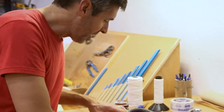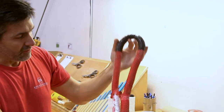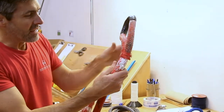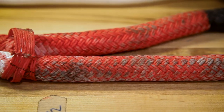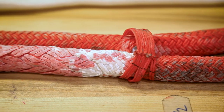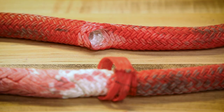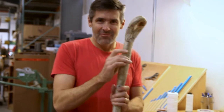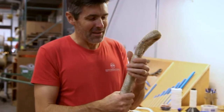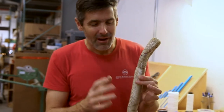Here's an example — this is from a major manufacturer — and this is just the tail end of a utility pulling rope. I cut this one apart to save you the work. On the outside, the stitching was just this decorative wrapping right here. It really looked cool and whoever did it did a nice job as far as the wrapping. However, you could see there was nothing really here to lock that in — it was just a decorative wrap on the outside, but nothing was penetrating the rope, the cover, and the core to lock it all in. A similar type of idea here — a lot of work went into this, it looks great, and this thing is like a baseball bat. But is it actually doing anything to hold it in there? At this stage, because it's been pulled on so much, it's probably solid, but there was a lot of work that went in that they probably didn't need to do.